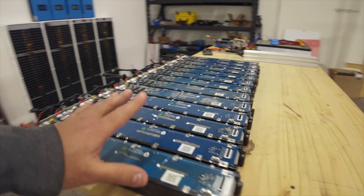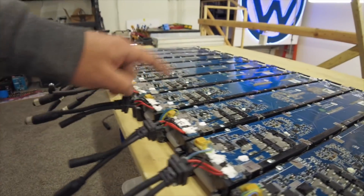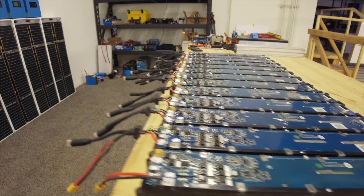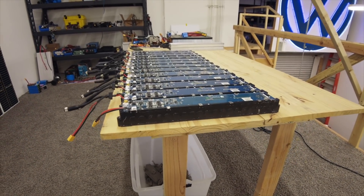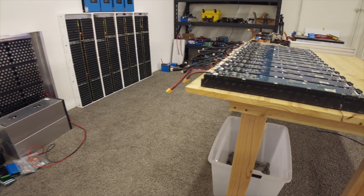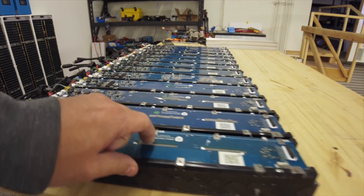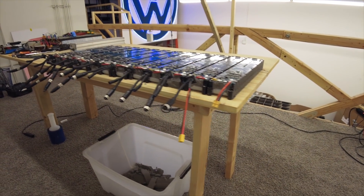These seem like they're going to be a lot easier to use in Phase 1 — before we figure out how to turn on the BMS that's already in there. There's quite a bit of work to get there, but we could already start using these batteries, and there are a lot available. The price is pretty good — just slightly above $100 per kilowatt hour, about $130 per kilowatt hour — for premium cells that are potted in there. That's also a thermal benefit: if a cell goes bad, it won't catch fire as easily because the rubberized material is fire retardant, almost like Tesla packs.